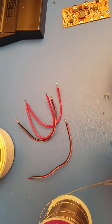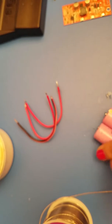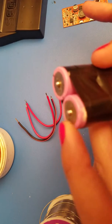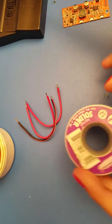Now with your solder points available on the wires, we're going to be wiring these up. On these 18650 batteries, you can identify the positive by the raised nub versus the negative, which is clearly just plain and flat. I'm going to start by soldering to the negative.